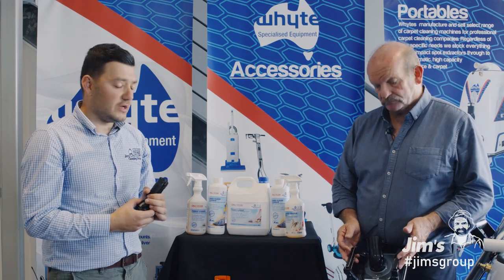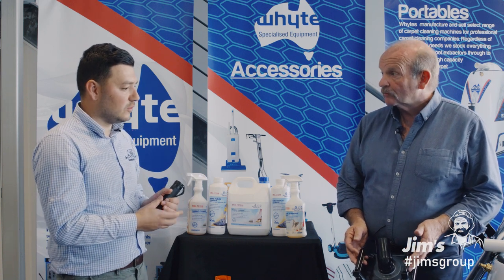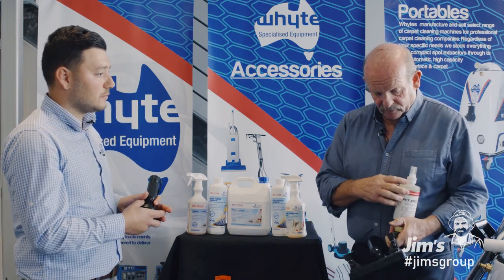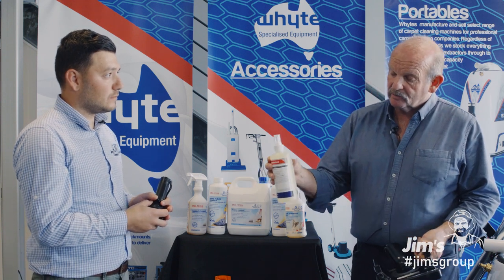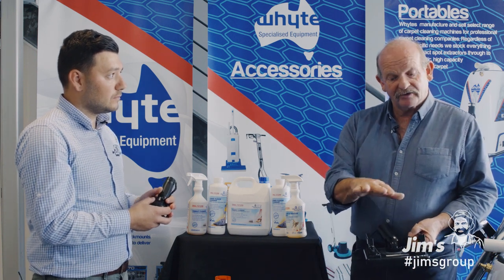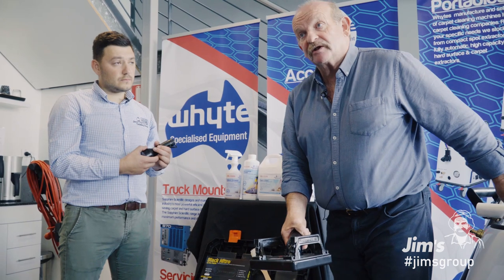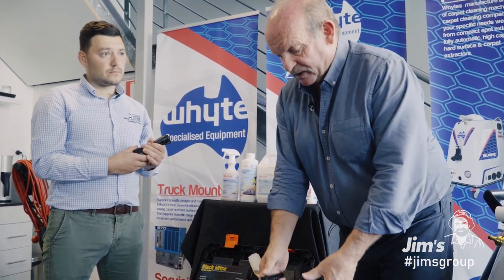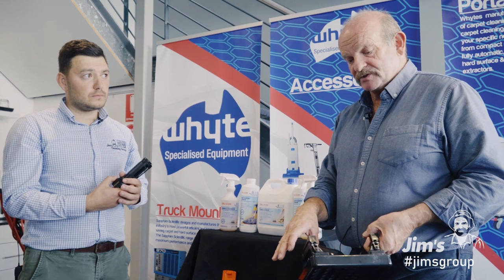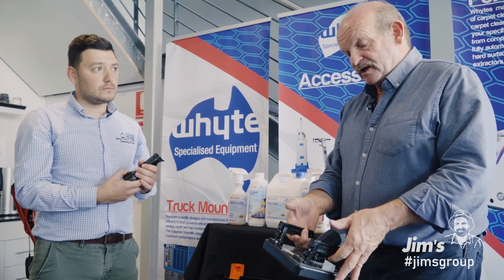Our trained franchisees can also provide clients with a pet urine decontamination service with the right tools. Geoff will give us an overview. Typically with urine, it doesn't always give you a lot of joy when working with it. But with this particular product, you break it down four to one, flush it onto the carpet surface because we need to get down into the underlay, down where the urine is. This tool goes over the top under vacuum — you push down and through all these air holes you're actually physically drawing that chemical through the carpet fibres, the underlay, and the substrate.